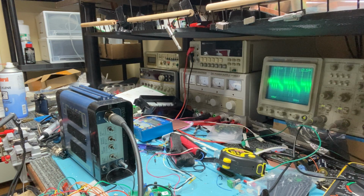Or if you've got some sort of wooden structure over it, you put your Hall effect sensors on. You can multiplex a whole heap of them together if you want to use an ADC or something like that. Or if you've got a 4-channel oscilloscope, stick 4 of them into each channel. Or you can adjust the offset voltages on them, maybe not directly 2.5 volts output, maybe 2.6, 2.7, 2.8. You're going to lose a little bit in overall dynamic range because you're squashing the voltage up, but you could have lots of them there and have a look at what's going on. But this is quick and easy and simple.